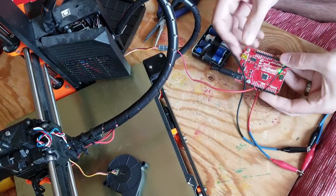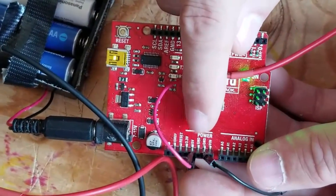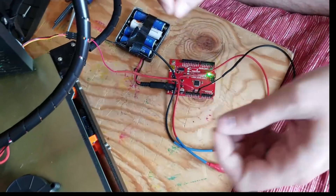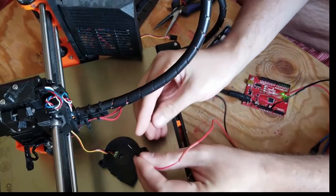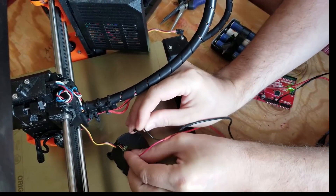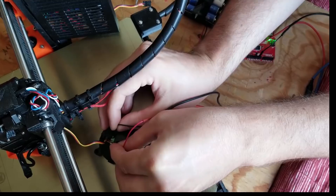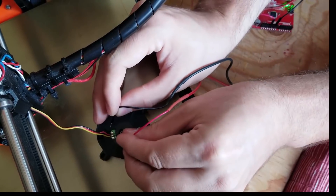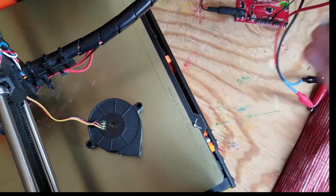In this particular case — and people who are Arduino people know this — there's that 5 volts, so I can pull that 5 volt off and plug it in. So what I did is I powered this Arduino board up, put the 5 volts on, and then I touched the wires directly as a test. And hopefully you might hear it. So there it goes — no problem. The fan itself is okay.